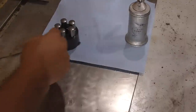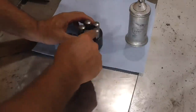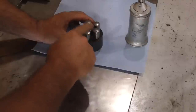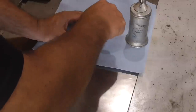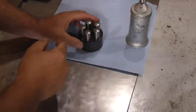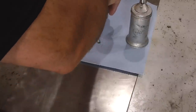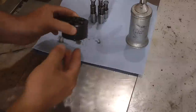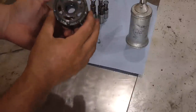I'm back and ready to inspect this thing. This here is the motor — there are pistons in here. They should all move up and down, they shouldn't be scratched up at all, and you want to check if they wobble, which would indicate wear. These look good. So what we're going to do is flip these over.